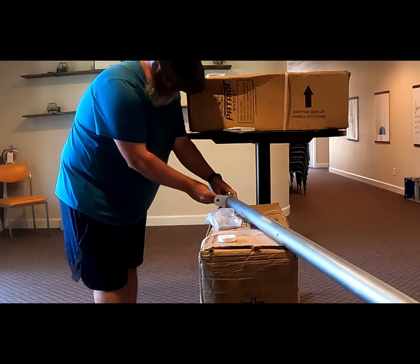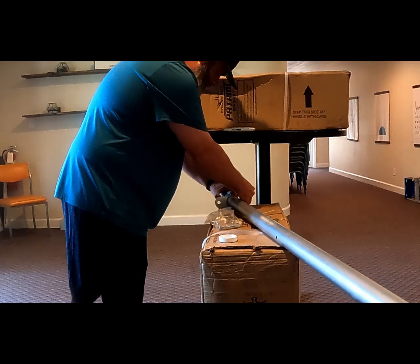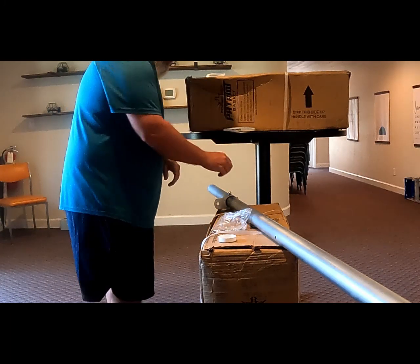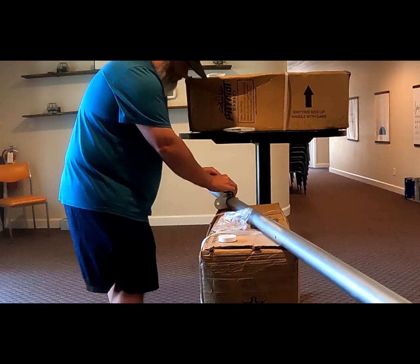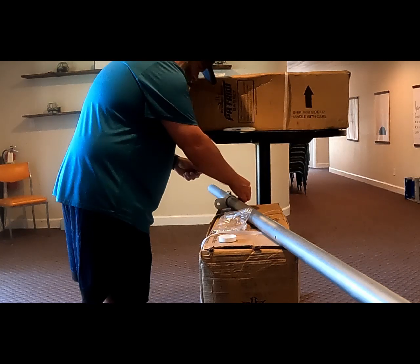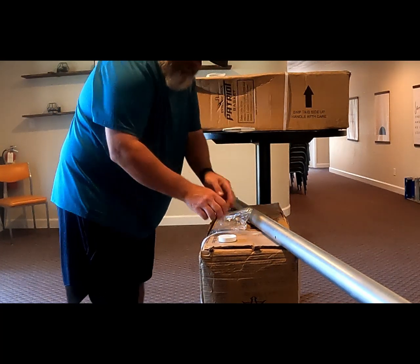I'll just quickly put these in, line up the hole, get them started first before I add my Loctite. Also have a set screw, holds pressure. That's it. Get all these started. Take a little bit of Loctite. Add just enough so that when that's tightening up, it'll take it with it around the thread.